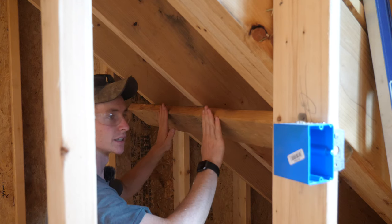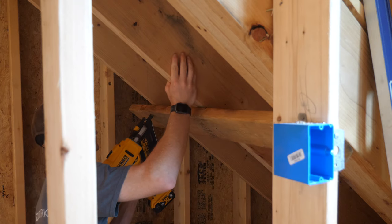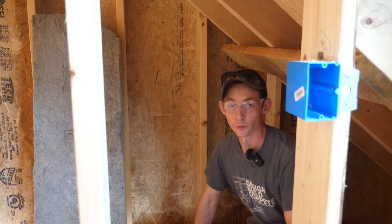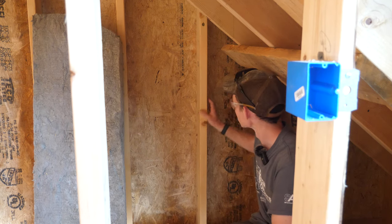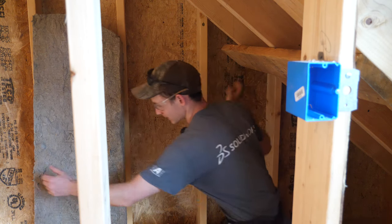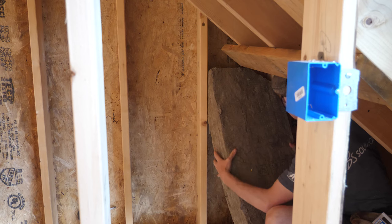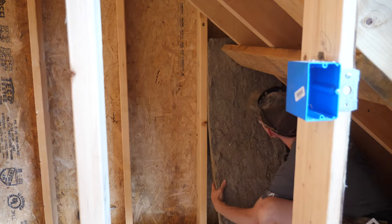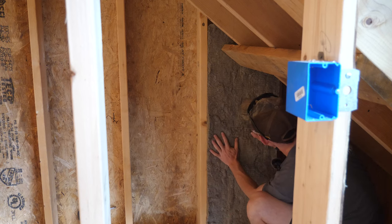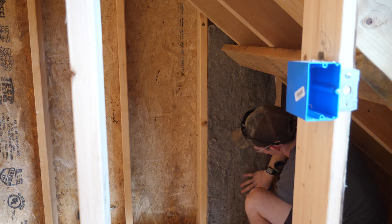Then I'll sort of build this thing in place, get the angle right, and we'll be good to go. Before I put the sidewalls on here I thought it would be a major pain afterwards to put insulation in, so I'm going to go ahead and throw some rock wool in here. I actually probably should have put it in before I even put this joist on, but it'll be even harder once I put the sidewall on. You can actually feel the air getting pressed out of the stud bay when you press this stuff in — I try to be nice and gentle so I don't end up with any dents or voids. It totally fills the stud bay up perfectly.